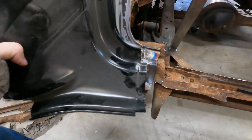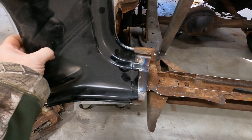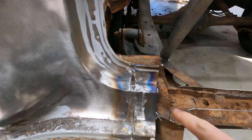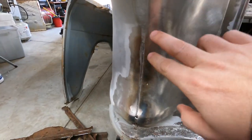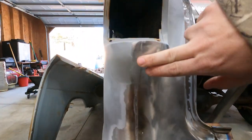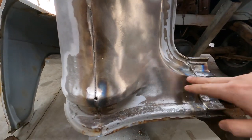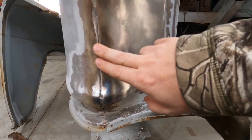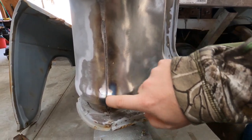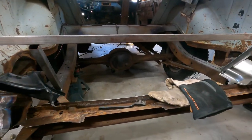But there's some pitting on this lower section here, and then the little hole is right there. So what I'm thinking is just cutting a lower patch out of here and welding in just the section that's a little poor, but leaving all the rest of it, because I want to keep as much of this original as possible. Melted out the lead that was covering this body seam, and I also did this one for this lower section, and I'll weld that in. I left the factory stuff right up here because I didn't have any need to melt that out. And then when I get the new patch welded in, I'll just use that aluminum filled filler that I got for replacing the lead seams in this spot to cover that over. Gonna put a backer on that and fill up that little hole. And that'll be good.